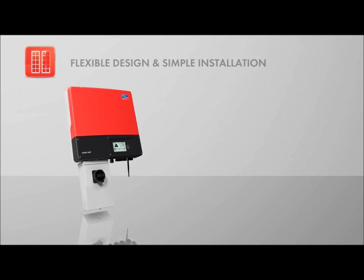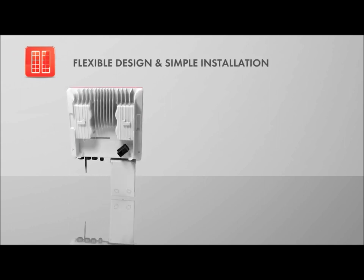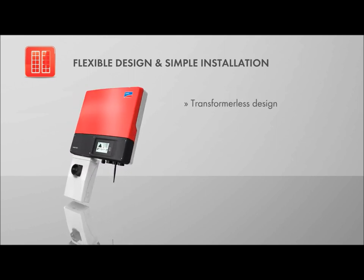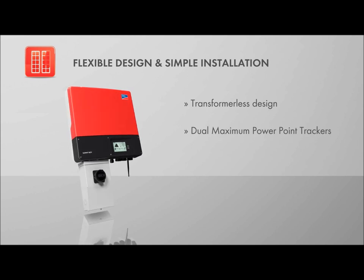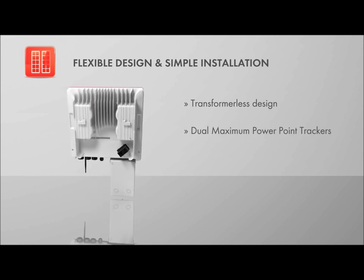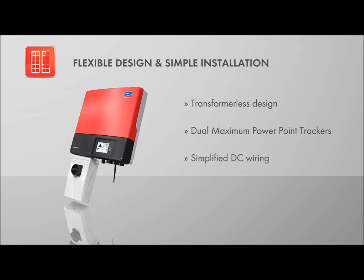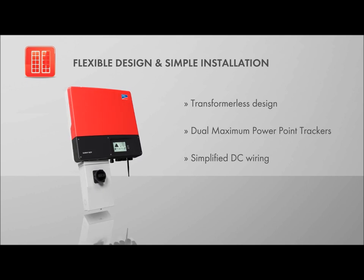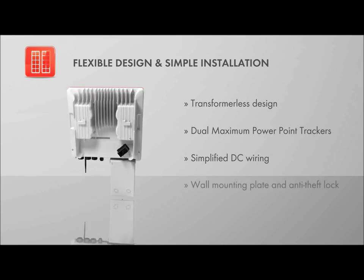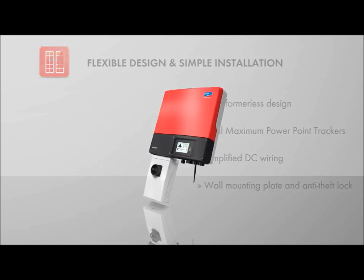Flexible design and simple installation were at the forefront of engineering this groundbreaking solution. The inverter is transformerless, which means lighter weight and greater safety. Dual MPP trackers allow for system design flexibility on homes with complex roof orientations and shading. Simplified DC wiring allows the DC disconnect to be used as a wire raceway, saving labor and material costs. A wall mounting plate and anti-theft lock provide ease for installers and homeowners.